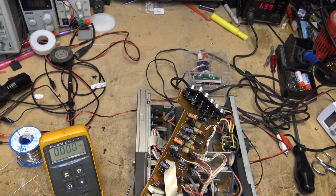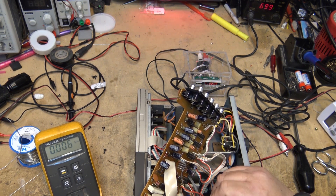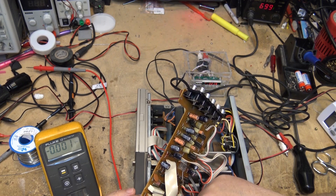Here's something interesting — I'm getting a bit of an offset voltage. I'm going to clip onto the negative terminal of the motor so I can get an accurate read. I'm seeing voltage when I press the volume up button — voltage comes up on the motor, but the motor obviously isn't doing anything. I'm getting minus 5 and plus 5 in the fast setting, and minus 3 and plus 3 in the slow setting. So that should be turning this motor, but it's not doing it. The volume control motor is bad.